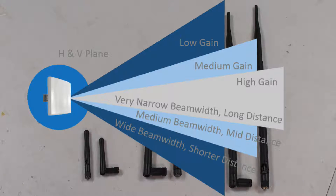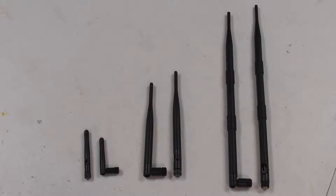Today in the field, I experienced a significant change between the 6 and 9 dBi Omni antennas. Using the 9 dBi Omni antennas, it took everything I could to get a link all the way out to 5,000 feet. I manipulated them every which way and found it very difficult to maintain comms. Not to mention that the 9 dBi antennas are too heavy for the transmitter and shift position at random.